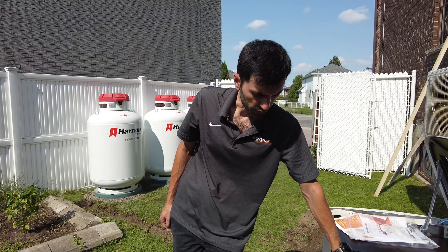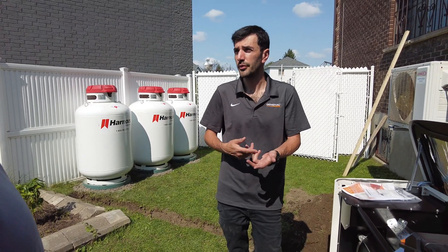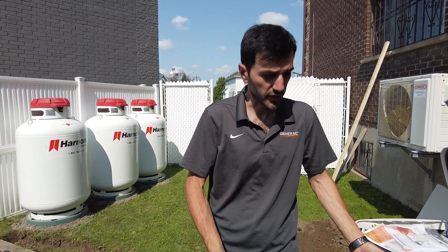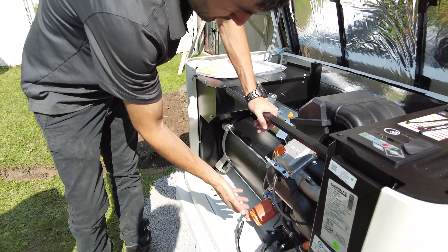If it was four days running continuously — like a disaster — give us a call. But you'll know there's a disaster. We always check the power outage map. Like the last storm in early August, we got messages from our customers saying everything is good and it's working. But I had a lot of calls where the installer was not certified and wouldn't answer the phone, so we'd get the calls asking what's going on. When maintenance is not done, most probably the generator is not going to work. If it's not working, there's something major to fix. But if we do the maintenance every year, we change the oil and oil filter, check the air filter — if it's not good, we put a new one.